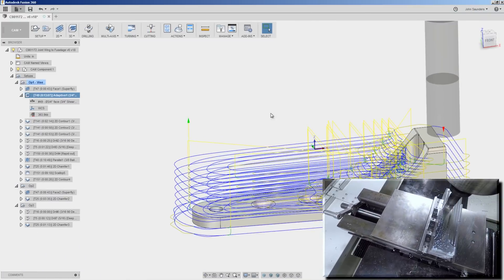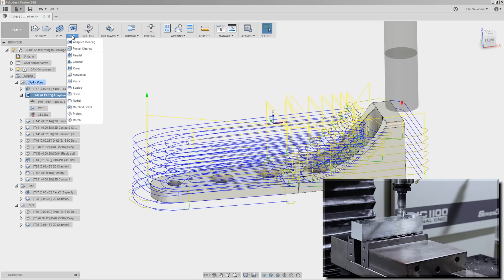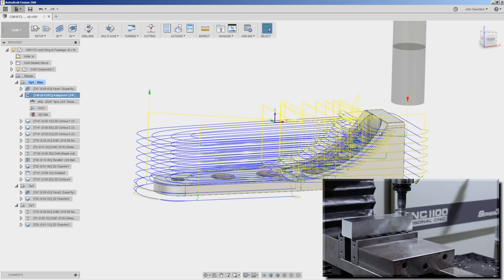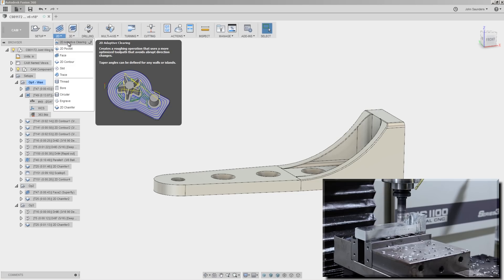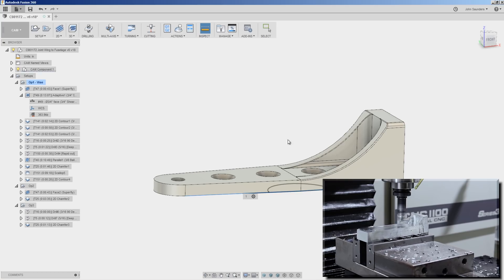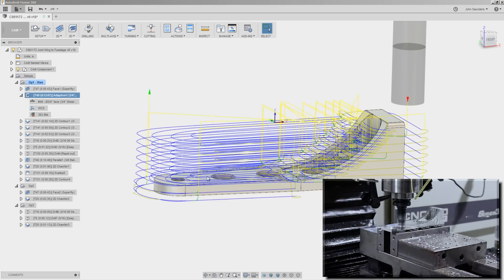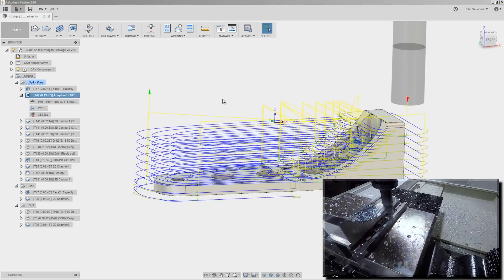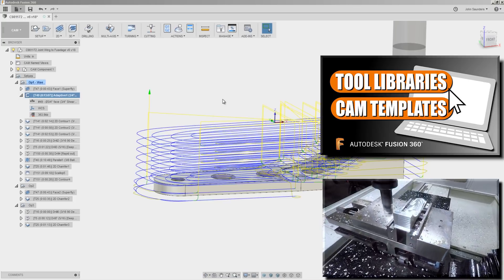We're using the 3D Adaptive for this operation — it removes most of the material for the part. If you're new to Fusion 360, there are a couple of differences between 2D and 3D Adaptive. With 2D Adaptive it only machines in two dimensions and you have to pick lines to build the toolpath, telling it where to machine. Whereas the 3D Adaptive toolpath not only machines in three dimensions but uses the solid body of the CAD file — literally in our geometry we have nothing selected, we just click OK and get the toolpath. Combine that with Fusion 360 templates from the NYC CNC templates and you've got a really powerful recipe to create good CAM quickly.